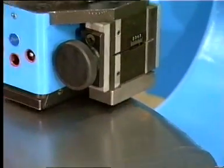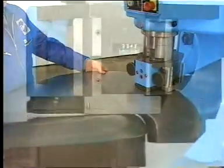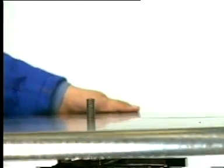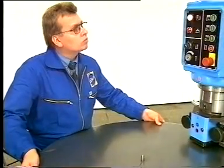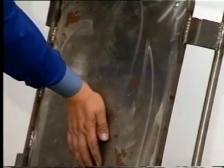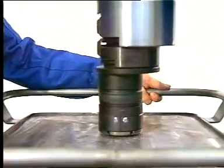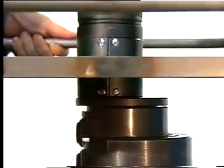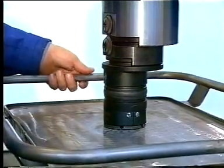For upsetting flanges to a maximum of 90 degrees, we have developed a special flanging tool. Various different tool inserts — so-called hammer and anvil — are employed to achieve the desired flange radii and heights. This tool allows other workpieces besides round ones to be finished. The tools used for concentric or spot flattening remove dents and buckles from sheet and deep drawn workpieces. The tool surfaces are optionally coated with steel or laminate and work from the outside edge towards the center. The result is a bottom plate, flat and unbuckled in all directions.